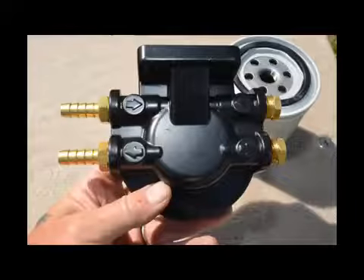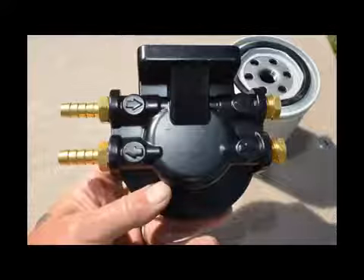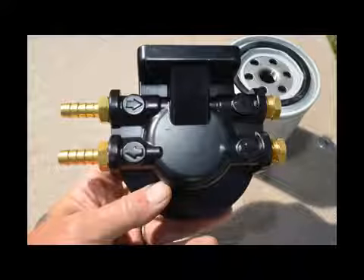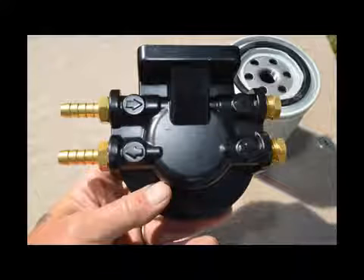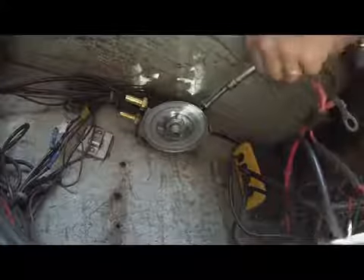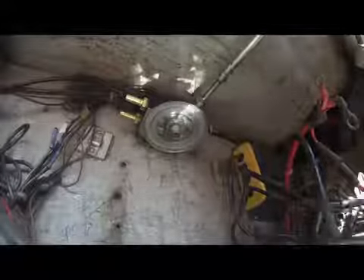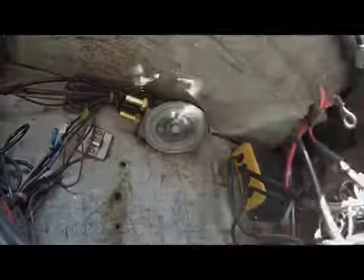The fuel water separator I bought lets you run the fuel lines in one side and out the other, or in and out the same side — which is what I'm going to do here so I can get the shortest route to my engine and my gas tank. I'll connect the fuel line from the gas tank to one fitting, and the other fitting will go to my outboard motor. I'm mounting the fuel water separator right under the splash well at the top of the transom in the bilge area, right in the center. I'm fixing the base to the transom with strong 3-inch stainless steel lag bolts — once I get this thing fastened, it ain't going anywhere.